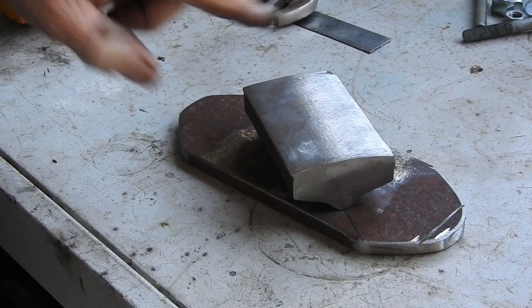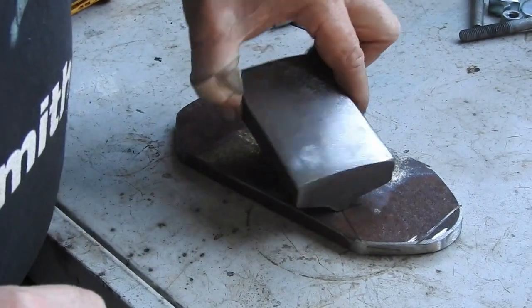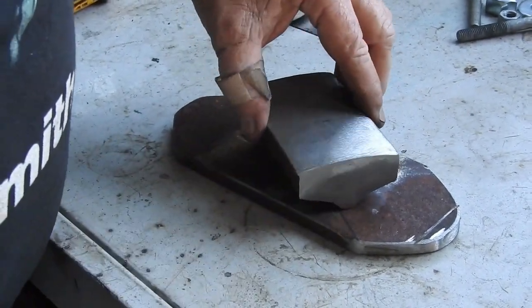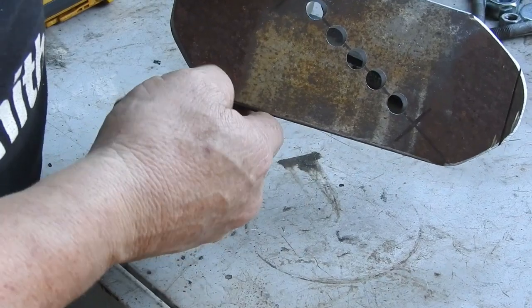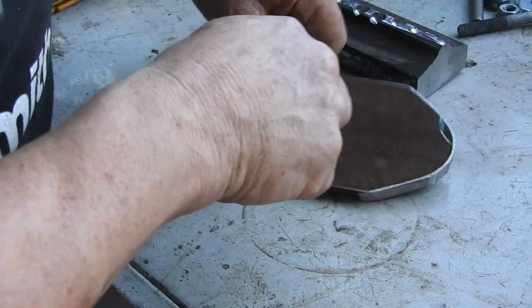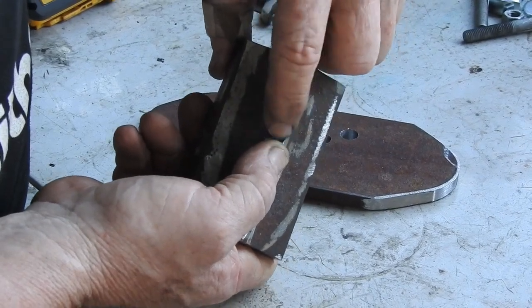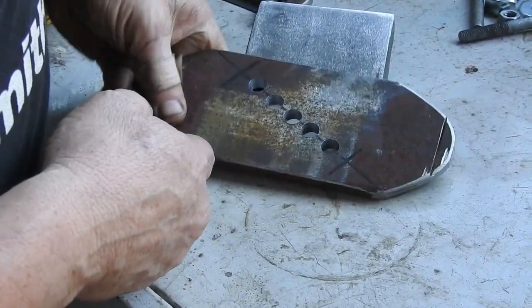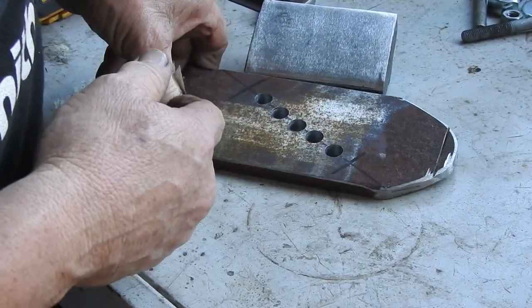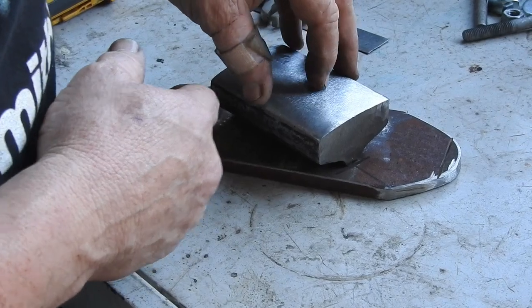Here's the die that I've been cleaning up — I've just gone over it with the sander and cleaned up the top face. I'll go over it and make it much smoother than that. My concern is welding this onto there — that's going to have a lot of pressure on it and it's pretty weak. So what I've done is drilled some holes in here and drilled some holes in there. The plan is to weld through these holes into these holes and try and make like a rivet weld, as well as doing the weld all the way around. Hopefully that'll give it a little bit more strength — it certainly won't do any harm, because that's asking a lot for weld to hold. Hopefully it'll all work and won't break.